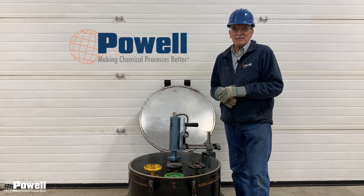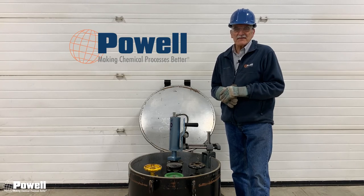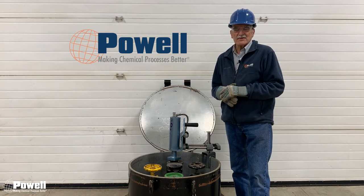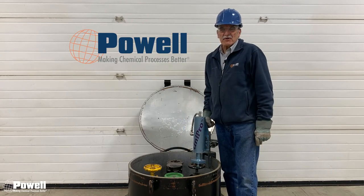The valve is easily identified by four circular holes that are inside of the hand wheel. This valve requires 120 foot-pounds of torque to close, and the UniPro will close the typical ACF-ARI high-torque valve in approximately seven seconds.